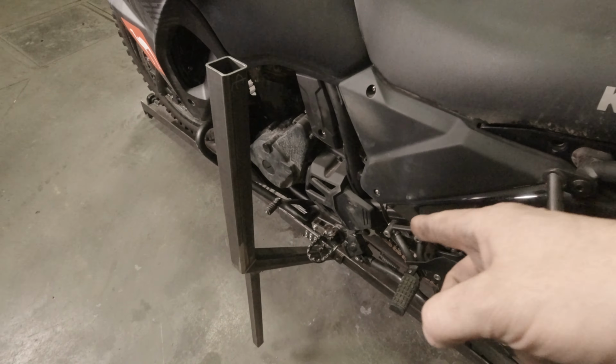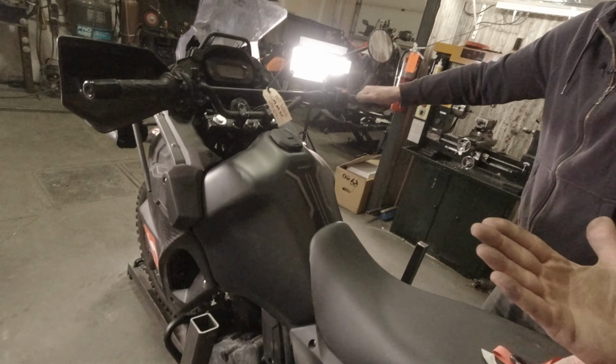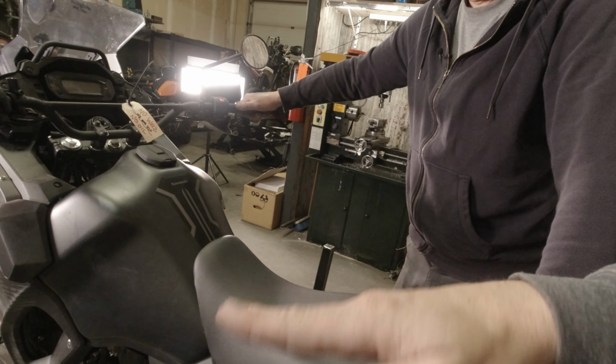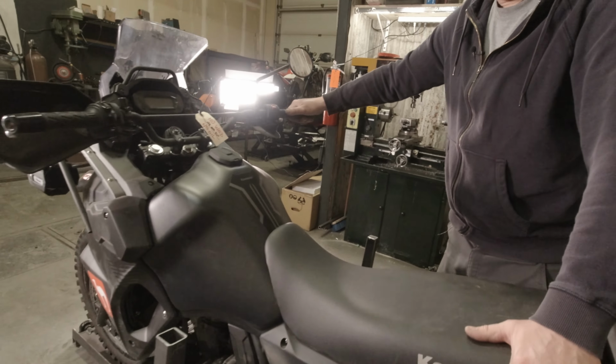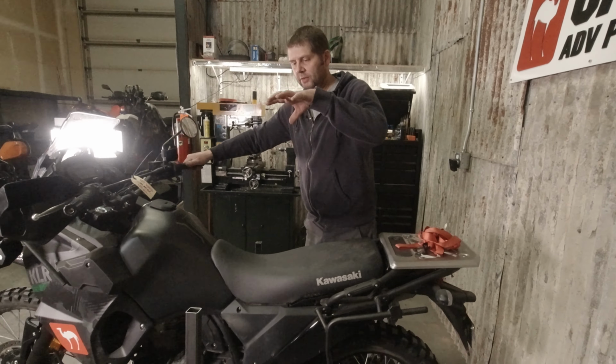So we're going to go from the foot peg with a strap over and take the seat off, a strap there and down to there, and then a strap from that foot peg over here. So we've got a crisscrossing of straps, so the bike can't lean this way and it can't lean that way. It leans with the apparatus. Everything must turn with the jig.